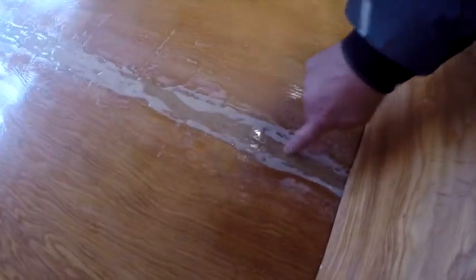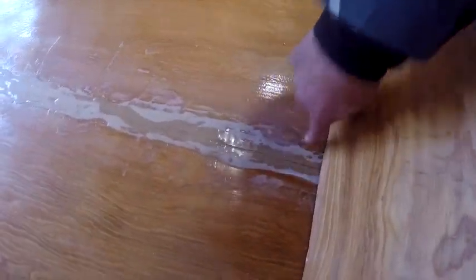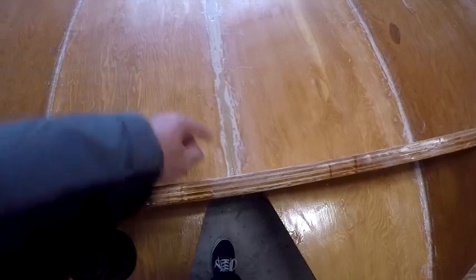Close and personal — this is the crack. The bottom cracked when I put the transom in place, so that didn't work out great. Better I find it now though. I put epoxy on it and of course it just souped right through, so I'll make some extra thick epoxy to fill that. That led me to be concerned that the back had actually shifted — which it obviously did — which is why when I pulled it all together I cracked the epoxy right there.